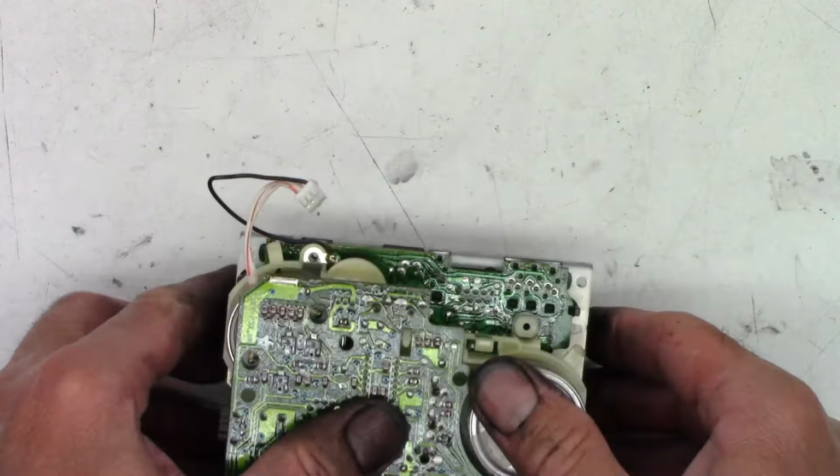So the next thing I'm going to do is eject this unit. It should, and it won't open up. See if it'll open now. Yep, it will. I want to go ahead and remove the pinch rollers and clean them. So there's a tab. My hands are freaking dirty from all these dirty belts. Move this tab up. Well, we'll close the door and try it.